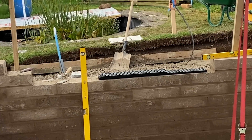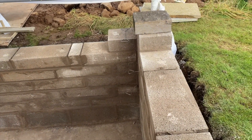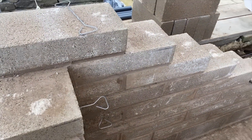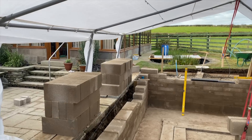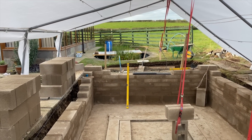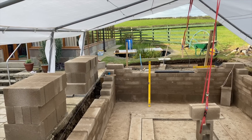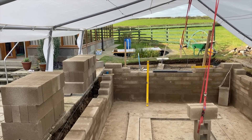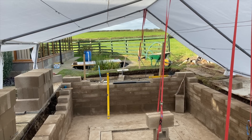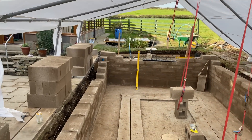The skimmer is going to go on the back wall, going into the filter bay. We're going to have a high return there, then come down to this corner where that return is going to be six inches lower than the previous one. The water is going to flow this way, and then in that corner is going to be the lowest return because the flow is all going in that direction. The skimmer is on the back wall, so if we have a low-level return in that corner it won't blow muck away from the skimmer — it's going to be an underwater return, going well underneath the skimmer, so the surface debris will still go down the skimmer plate. The skimmer will be running into a 24-inch bead. It's just ideal to show people the levels involved.